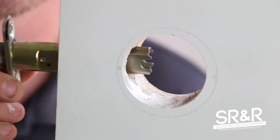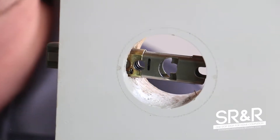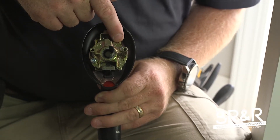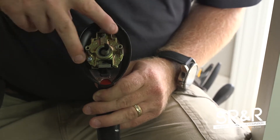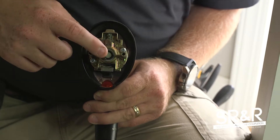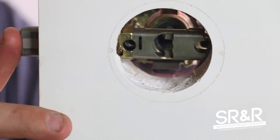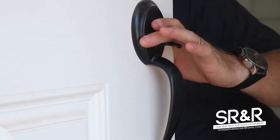Then you go to install it and it's the right distance it's supposed to be. Another problem with these front door knobs is that they come out of the box set for either left-hand or right-hand turn and it needs to go the opposite direction. All you do is loosen these two screws, pull this piece out, then push it down — when it goes back down it's set. Then just tighten these two screws up and reinstall it.